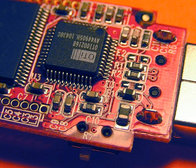Topic: Non-package devices. Although surface mount, these devices require specific process for assembly. Chip on board (COB), a bare silicon chip that is usually an integrated circuit, is supplied without a package, usually a lead frame overmolded with epoxy, and is attached, often with epoxy, directly to a circuit board. The chip is then wire bonded and protected from mechanical damage and contamination by an epoxy glob top.